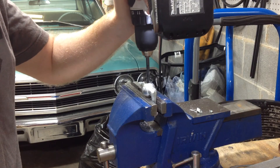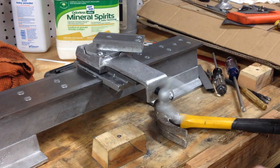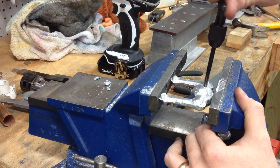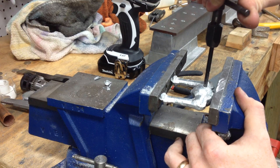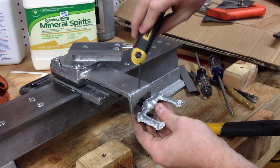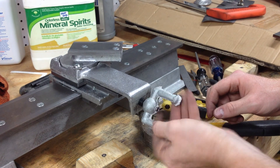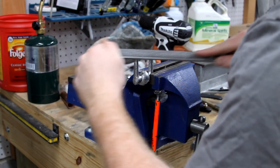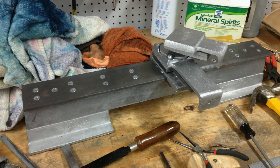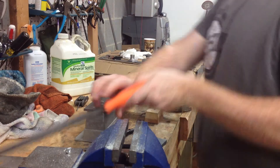The fit was still tight, so I used a quarter-inch drill bit to open it up. It seems simpler than casting on an arbor. I drilled a hole for the set screw, tapped it, and mounted it on the drive screw shaft. Cleaning up the ball handle with a file was slow going. A belt sander sped up the work. The next video will show completion of the carriage assembly, focusing on the preparation of the compound slide. Thanks for watching.